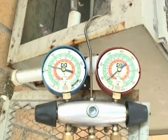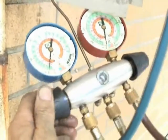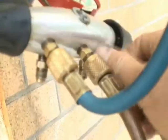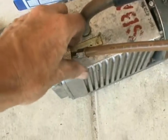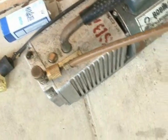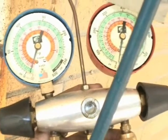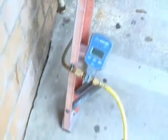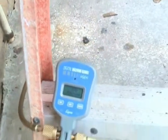Watching the gauges go down in pressure. Now that all the nitrogen is out of the system, you can open up both the low and the high side. Make sure the hoses are nice and tight so they're not going to leak, and make sure the hose on the vacuum pump is tight and it's plugged in. We'll turn it on — now it's going to put the system into a vacuum. The vacuum pump's been running for a while. Here's our micron gauge and we've got it down to 370 microns right now — really good. All you really need is to bring it down to 500 microns.